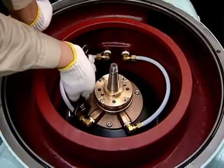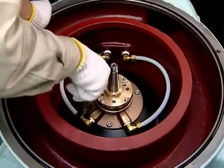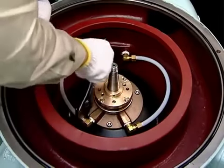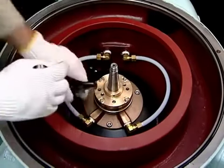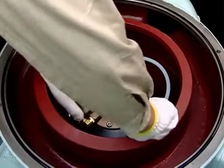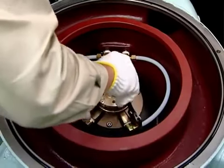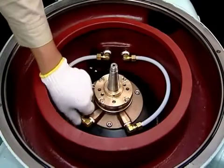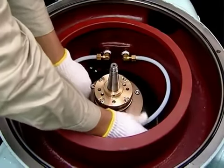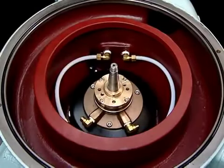The water supplying device is essential equipment to ensure that the main cylinder operates correctly. If the water slits become occluded with fur, the required operating water may not be supplied to the hydraulic chambers in the bowl, causing failures in emission and closing pressure. Occurrence of dirt in the water supplying device varies according to the quality of the water. Inspect and clean the water supplying device before fur can form.